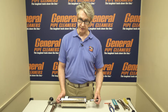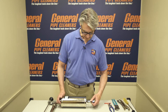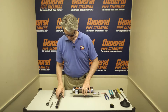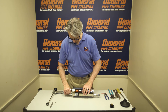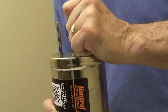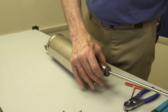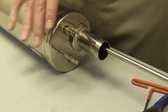After you've replaced everything that you're going to replace, we recommend reassembling in reverse order — the same way that we took it apart. So first, push this back in and start it by hand. Next, put the pressure cylinder back in. It's easier to do it this way. To get this started, sort of turn it sideways and use your fingers to help it get over the lip, and just push it right down — just like that.